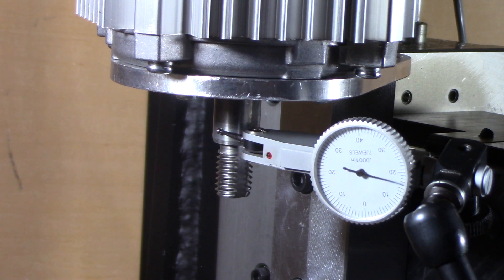What that also tells me is that this extra pulley I purchased is not going to improve things one bit, because the problem is with the shaft. Given that I'm going to be using belts to connect the two pulleys together, it shouldn't matter at all. But this is probably me just trying to get things absolutely perfect when they didn't need to be perfect. Anyway, I thought you'd like to know what the resolution was. It's nothing wrong with what I was doing — I think I was nailing it in terms of the skill level that I have now and getting the bore just right. But if the shaft is not straight, you're going to get pulley wobble.